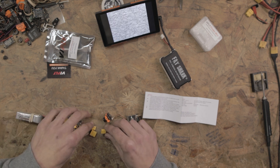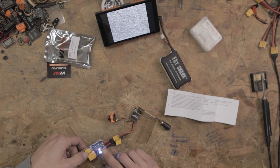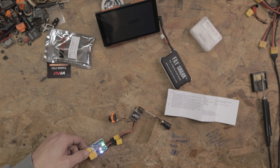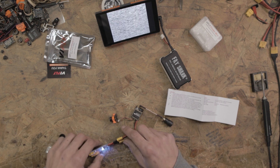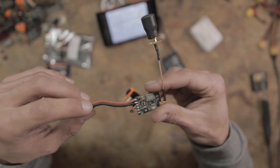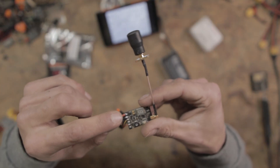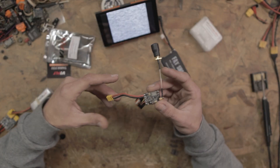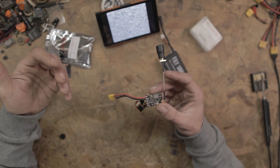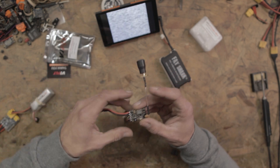You plug in your device and then press on — and now I press off. So it basically acts like a switch. What I'm going to do now is take this XT30 and swap it in backwards, then plug it in with the smoke stopper and see if the smoke stopper does what it's supposed to. Let's go ahead and give this a try.